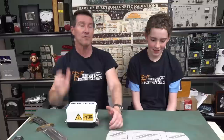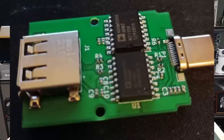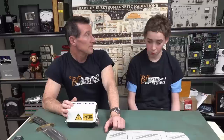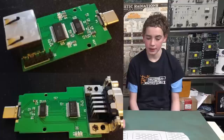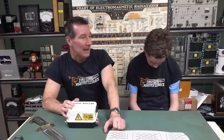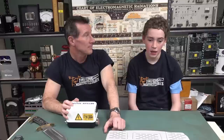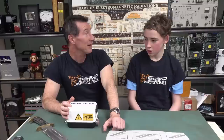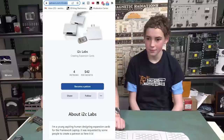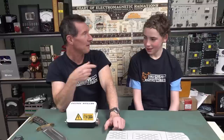He's 13, and he's got his own lab, making his own stuff, and he's starting to sell boards for the new Framework laptop. He's got several different boards - the one about to sell is a UART board. He also has an Ethernet one which failed, and then the company came out with one so he stopped working on that. He has a serial adapter for networking gear with an RJ45 port along with a basic serial adapter to a DB9 connector. He has around seven or eight people interested for the UART one specifically.